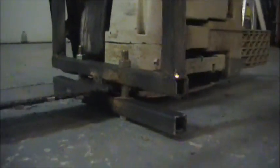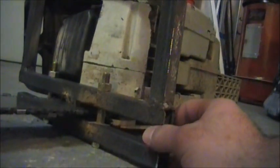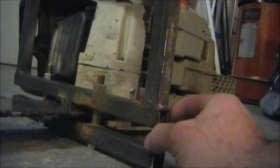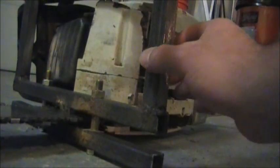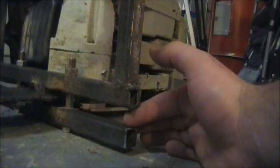You also want to look at the square tubing here. As you tighten it down, you may get some flex out of both of these pieces. If the flex is causing your vertical piece to come out of alignment with your rectangular tubing up here, you may have to put a spacer in right down here so that you can eliminate that flex.